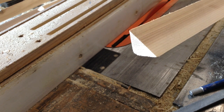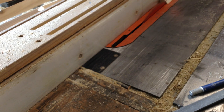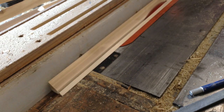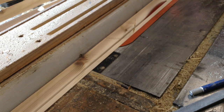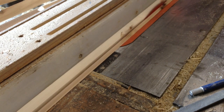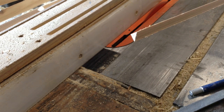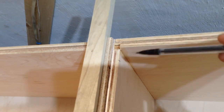The top side also had a chamfer detail on it in the source photo they sent me. I technically could do it with plywood — I could put putty on there and it will be painted — but I happen to have this scrap cedar laying around the shop that was already at a 45. So I decided just to cut the edges off of it, which would leave me a perfect little 45-degree chamfer. Then I just went through and inset that around the panel.